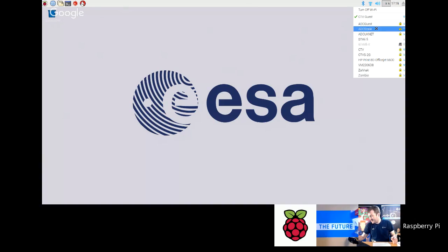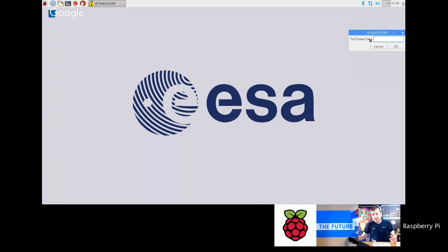Oh no! It's obviously the same. Let's go BT Wi-Fi. No. Okay, well, what should happen is the moment you come in here and click on any of these, it should actually just, there you go, like that. And then you just type in the Wi-Fi password into there and click OK. And that's you on the Wi-Fi, okay? But if you plug it into Ethernet, you'll just see these two arrows like that. You can hover over there and you can see what the IP address is. All right.